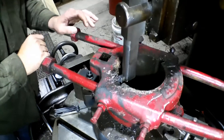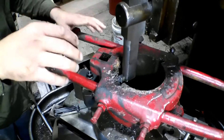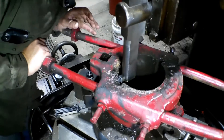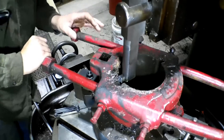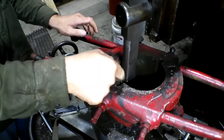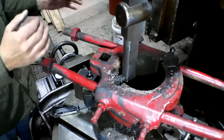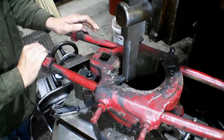What I was seeing there is the keyway itself - this thing must have been wobbling a little bit and it was cut in a bit of a taper. So I had to touch it off and come in a little bit further, and I think I got it mostly cleaned up. I didn't have to take much off. Now we're going to crank it over and clean up this side at the same depth, then check it and make sure we're right where we need to be. May have to adjust a couple thousandths both ways just to clean it up, then spin it around and do the other side.